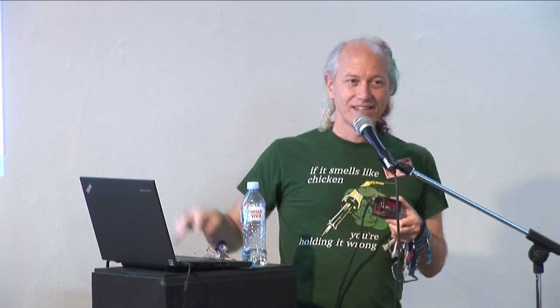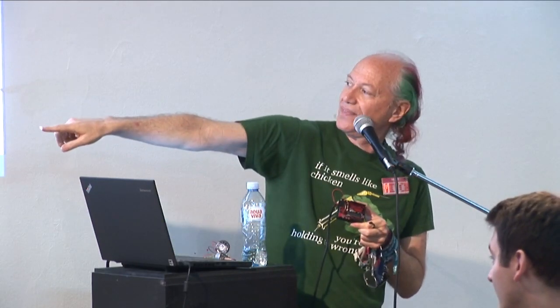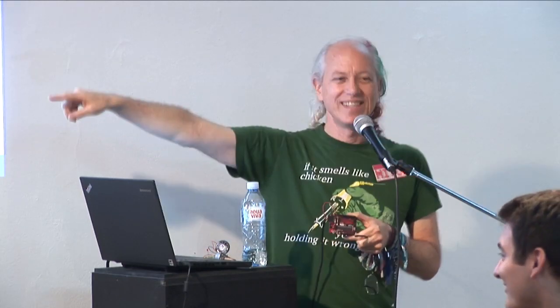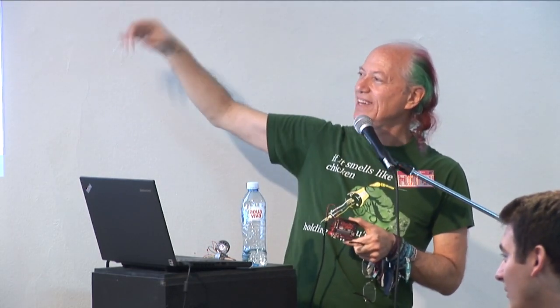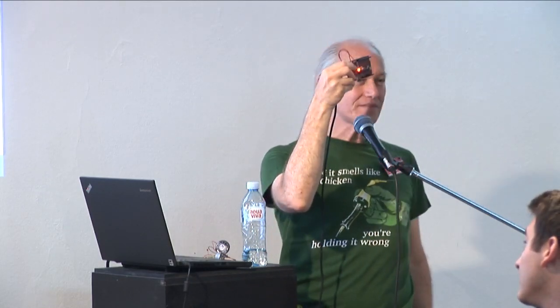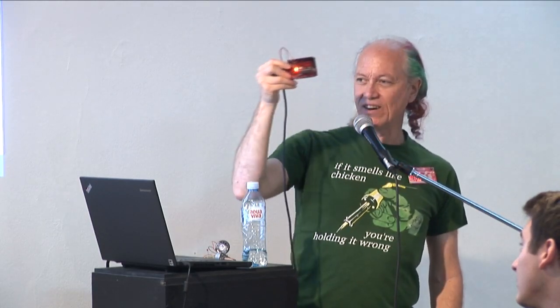So if I press this button, it will convert this text into a form the microcontroller understands, send it through the FTDI cable into the memory of the microcontroller, and then run it. So let's do that. And then it'll start blinking this way instead of this way. So watch what happens. And see, there's a progress bar over here. And see over here, it says compiling sketch. That's a scary computer science word. Compiling means converting to a form the microcontroller understands. Uploading means it's sending the information to memory where it's now there, and look at the way it's blinking now. On for a second and off for a second.